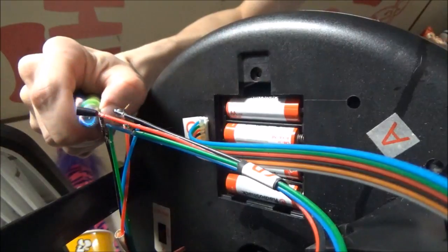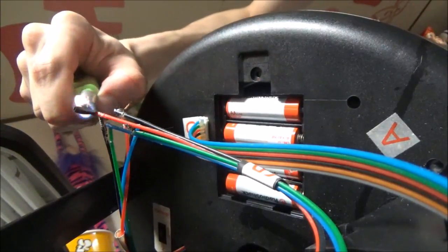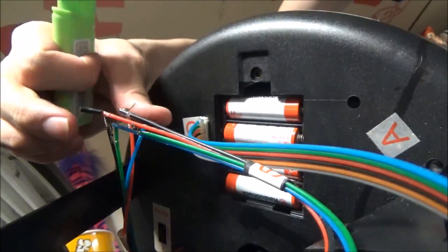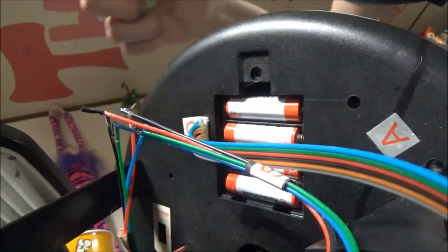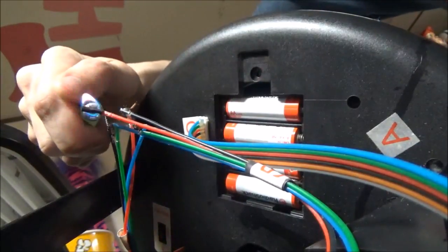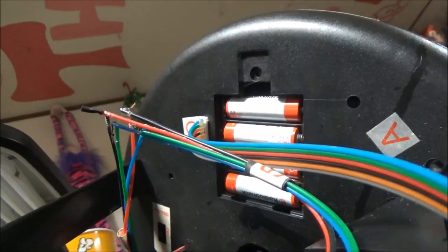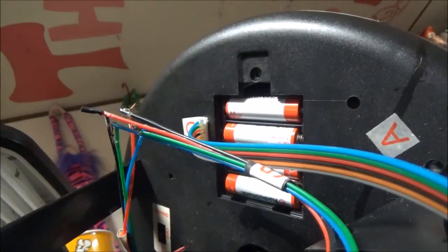But yeah, when it melts together, this rubber stays on. It doesn't come off. So if these wires all touched each other without this tubing, it could really cause it to fry or start smoking or something like that. It will create a lot of problems. So you want to cover it with heat shrink like that. Trust me, I've learned that lesson. There's been many times where I've had that happen.